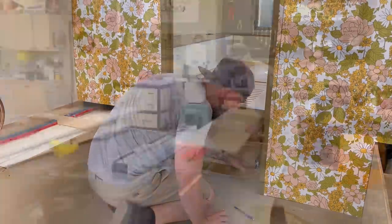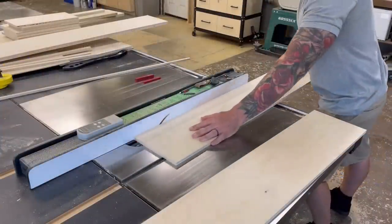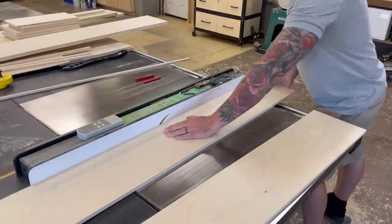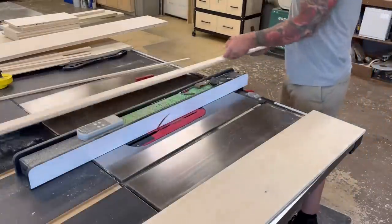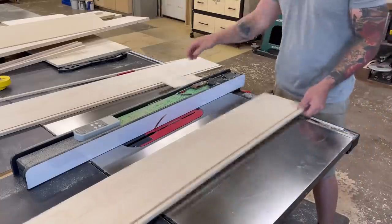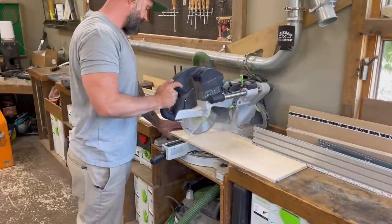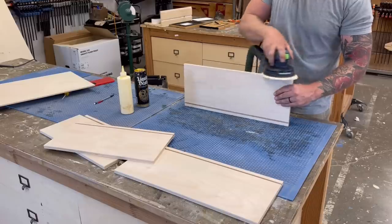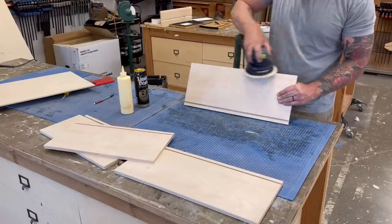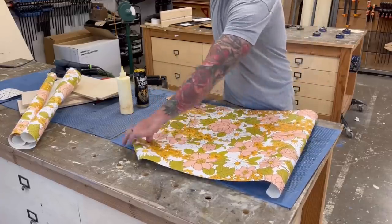With my measurements in hand it was back into the shop to make a drawer box — once again in my happy place. I've made so many of these drawer boxes I could probably do it blindfolded — I mean they wouldn't look good and they'd be out of square, but I could probably do it. I do have an in-depth video on my channel on exactly how I make these. Basically I rip down strips of Baltic birch, add a little groove at the bottom to hold a quarter-inch plywood panel, and glue and tack them together. The orientation of gluing and tacking them actually makes an incredibly strong drawer box — I've been using these for years and have never had any issues.